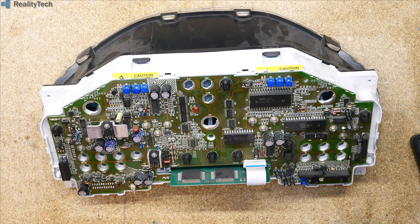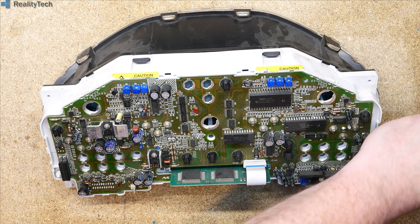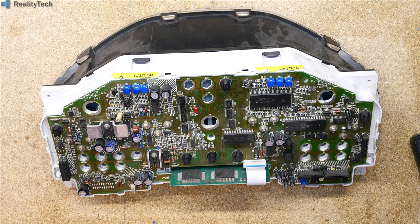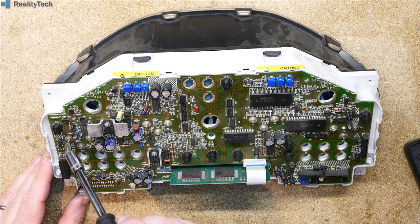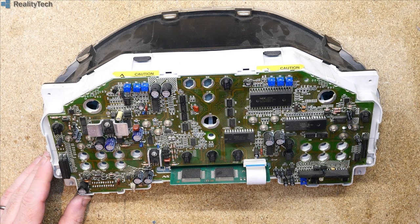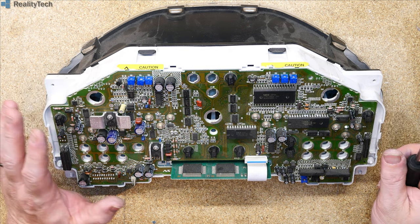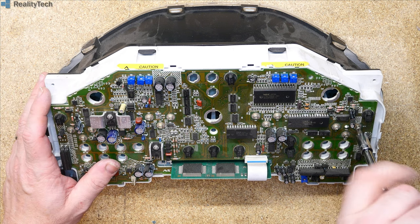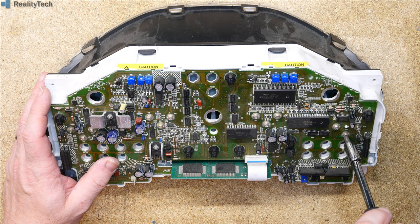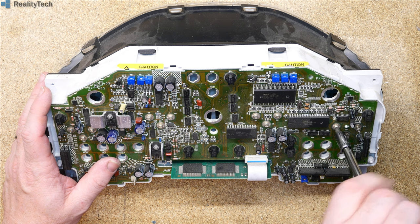The crosshead screws also serve as the connection between the dashboard PCB and the gauges. So it's essential that these screws that I'm about to remove, so these three here, these three here, these three here, and these three here, are tight and clean. Not seen it on P38s, but I have seen it on Volkswagen Audi Group vehicles where gauges have played up, and it's quite simply been these screws are either very, very contaminated or aren't even tight. So let's just spin these out.